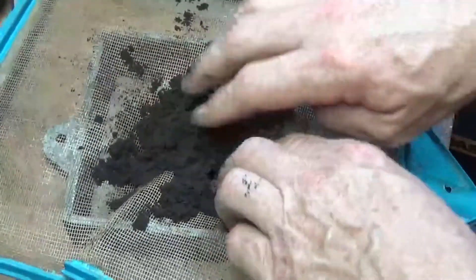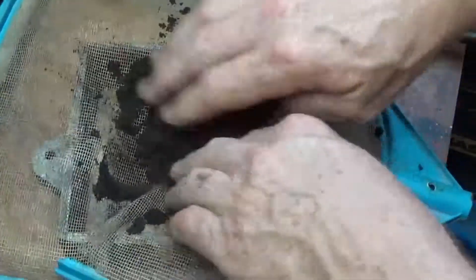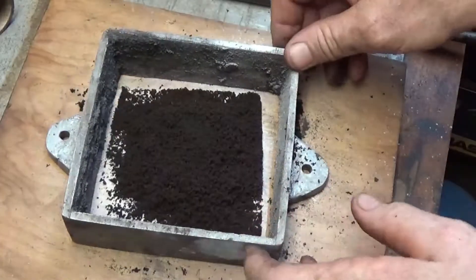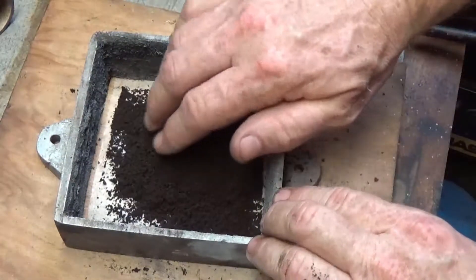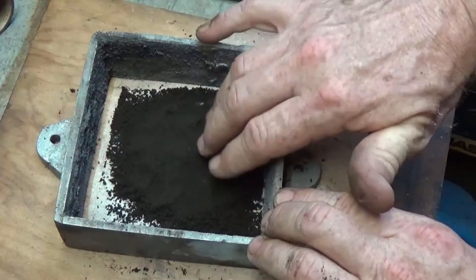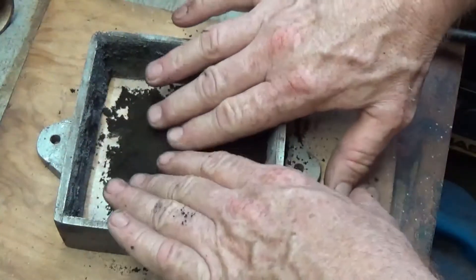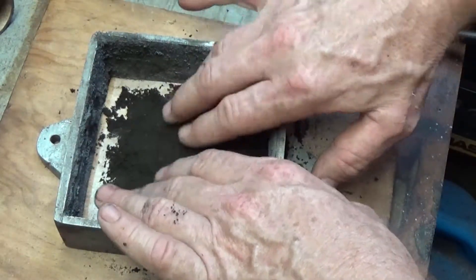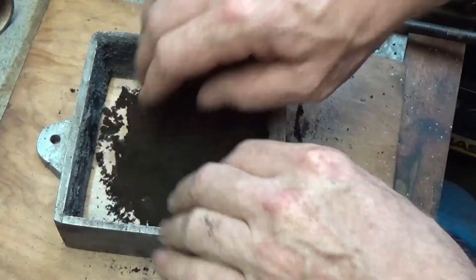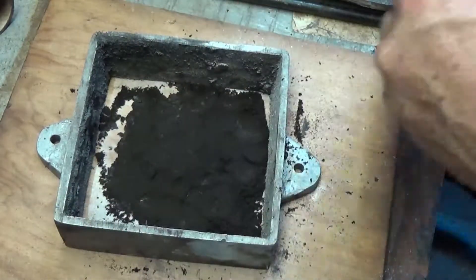Once it's covered, then I don't care what is on the outside. I'm not going to sift this whole piece. So there's enough sand covering the piece of wood. This is very compactable, and that's what we're trying to do here — that's a combination of the fineness of the sand and the oil. The oil actually adheres to the sand and sticks. A good test is to crumple up a piece — you can break it off. If it just comes apart in your hands, it's not hard enough, not solid enough, and you need to add more oil.